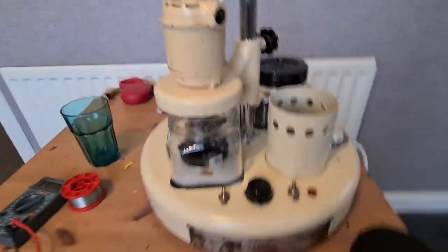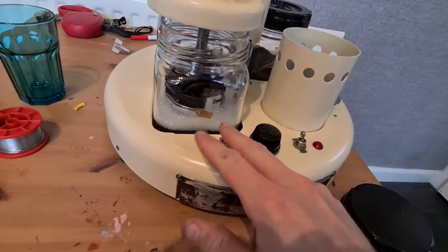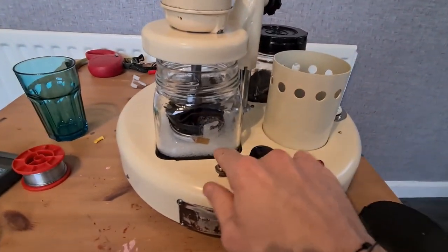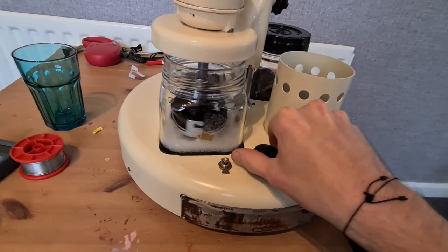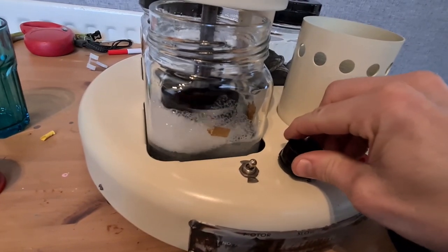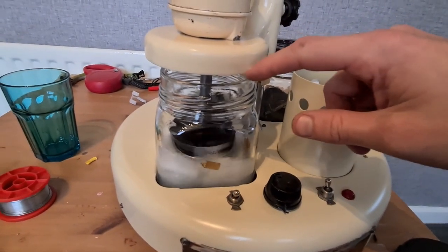I'm going to put a cage on, put some kind of a soapy solution in one of the jars and go through the cages, give them a spin and a clean out. I need to find a golden speed for when we're doing watch cleaning — apparently you should be looking for the cleaning solution to rise about an inch up the jar when it's spinning. Anything more than that is a bit too fast. The prongs on here are designed to mix up the solution as it's cleaning. I'm happy this is a Bakelite holder.